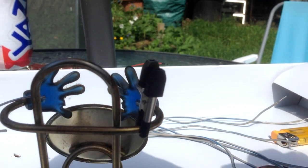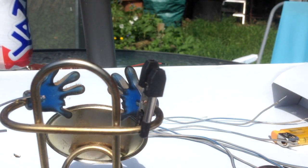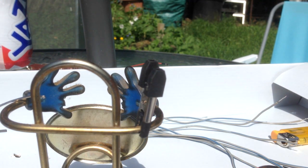connection. You can just get your soldering iron and brush over it as well. Not as effective as the lighter though. It does work. I'd have to get another lighter and just quickly go over that again, but as you can see, it's more or less shrunken onto there, and you do that with pretty much any connection you want to make, and that should be a good solid connection for a while at